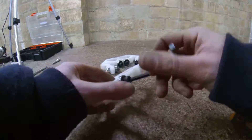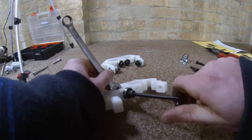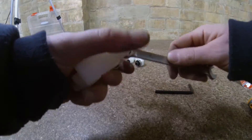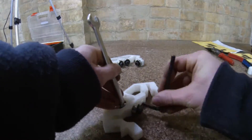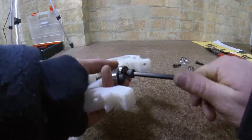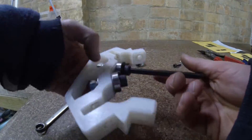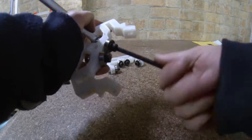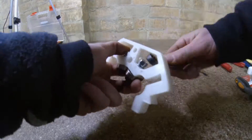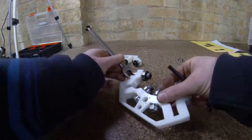After assembling the Z axis assembly, here I am assembling the XYZ T8 piece for the center assembly. I've chosen to install the nylocks on back to front with washers. If the nuts are used the other way around — same with the rollers — there isn't enough length to engage the nylock properly. In some areas where I did want to use a washer there wasn't enough room, so I tin snipped the side of the washer off for the areas that needed it.